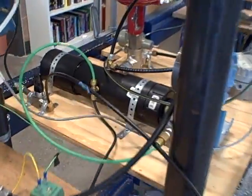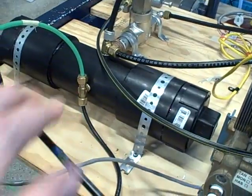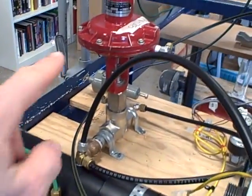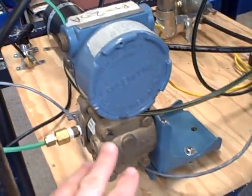What we have here is an air pressure control system. We're controlling the amount of air pressure inside that black plastic pipe, and we're doing so using a red control valve, pneumatically actuated, and we're measuring the amount of pressure in the system with a pressure transmitter.